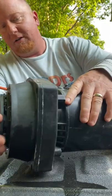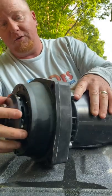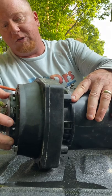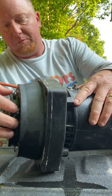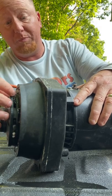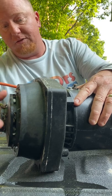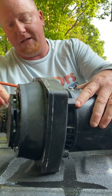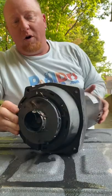This is the impeller. Let's look in there. Rocks. It does spin, so that's a good sign. That tells me that the motor's not broken. So it's spinning. And I don't know what these little guys are, these little white beads. Maybe that's like some airsoft something, or maybe they're little pebbles from who knows what. But what needs to happen is we need to clean all of this stuff out, because water flows through here. It's like a fan blade. And if the fan's clogged up, then it can't move water.